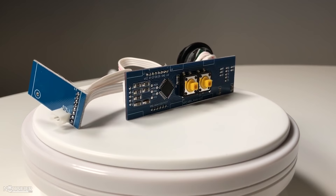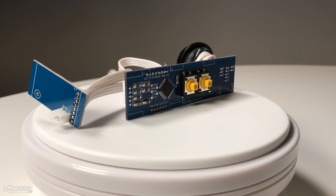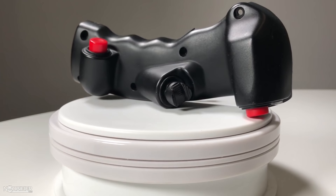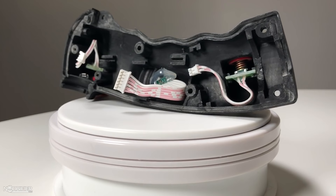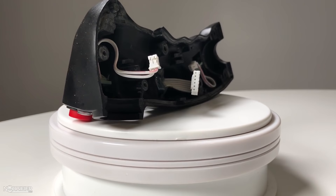Other buttons that are remotely mounted also use this construction, except that wires are used to connect the satellite boards to the main. This is very simple and effective, ensuring that everything is terminated by a plug. Technically, replacement parts could be sent, or the end user with some basic skill could perform self-repair or modifications with ease. Some switches are held in place with hot glue, which brings the overall impression down a notch when compared to other grips, but nothing would ever wiggle loose. The Z-axis uses a hall effect sensor which operates precisely without any contact.